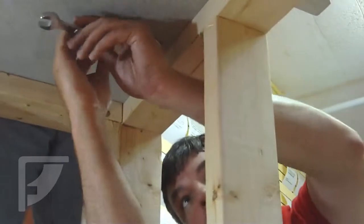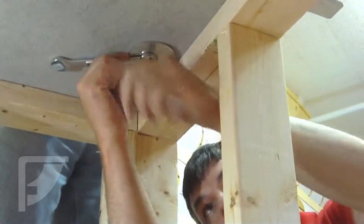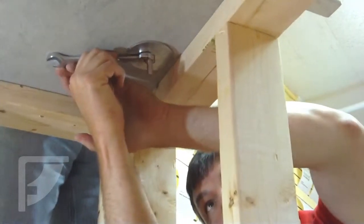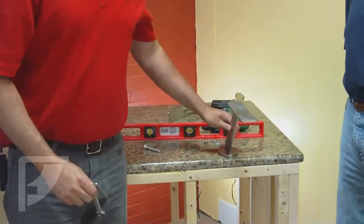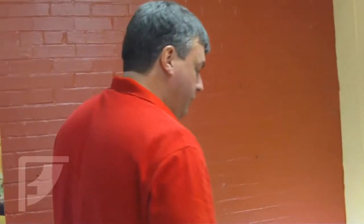So, I'm just going to put a wrench on here, and Brock is going to run his screwdriver. We're just going to tighten that down a bit. You might use some adhesive up underneath your bracket. If you do use adhesive on your bracket, you'll want to know that you probably aren't going to get the bracket off of the countertop ever. So, just fastening it in there and making it nice and tight should give you a good enough hold that it's good and secure.